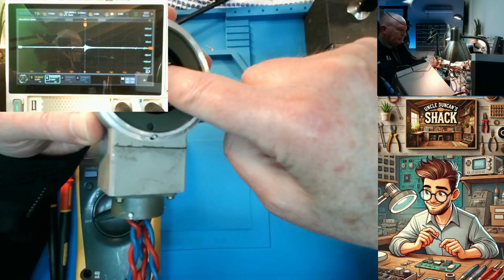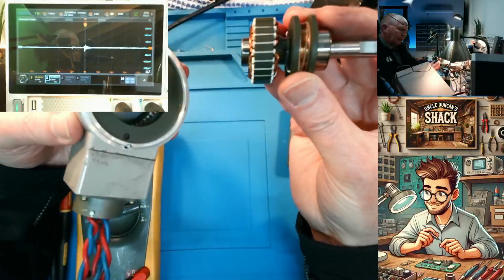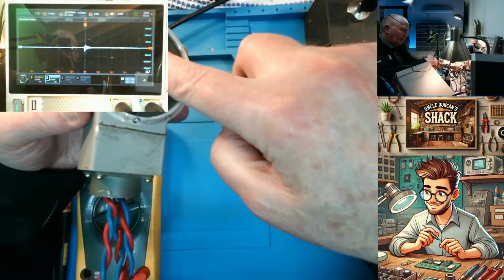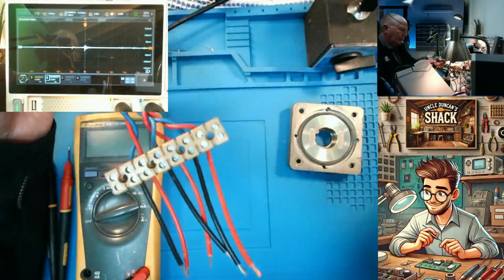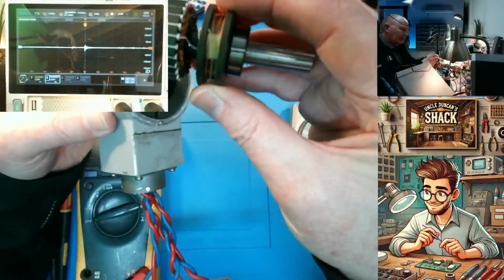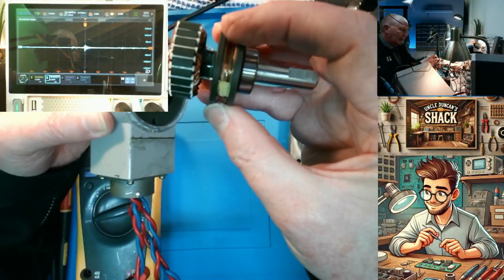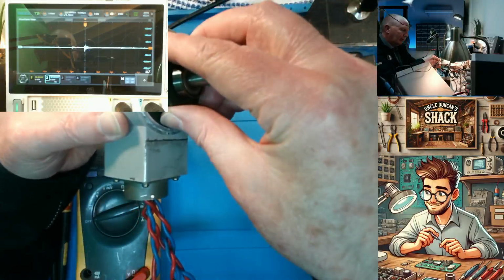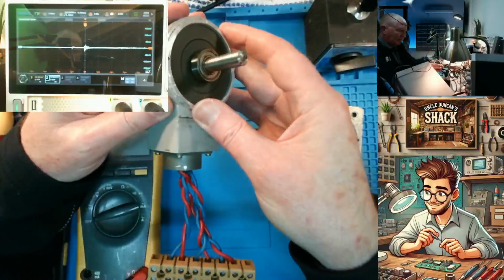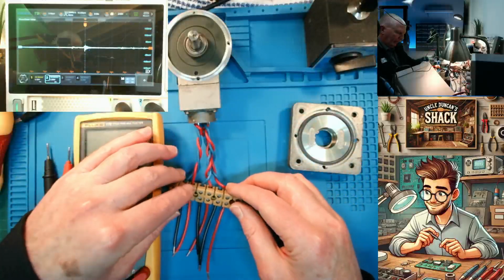Alright, primary, secondaries. So you've got a winding on the rotor and 3 windings on the stator, hence you've got 6 wires. So here's your rotating winding. So this is a nicely built rotor. You can see exactly what's going on there. It's a very nice illustration of a resolver. This is a resolver used for position feedback, and it's obviously an absolute position feedback device.